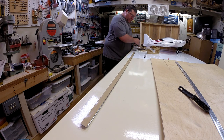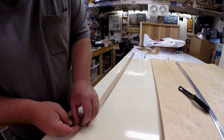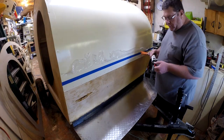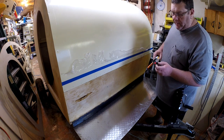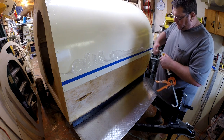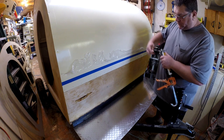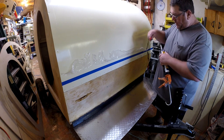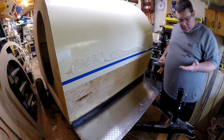With the combination of that polyurethane caulk, I think that will give me a good seal. Now that it's on there, I'll give it a light press and then pull up the tape. Between uses of this Trim Pro 635 caulk, I want to make sure it didn't dry out — so what I did is put a wire nut on the end of it and then tuck some electrical tape around it. Of all the ways I've tried over the years to keep caulk from drying out, so far this seems to work about as good as anything I've tried.